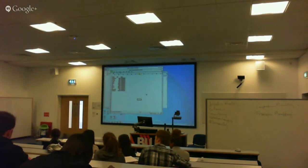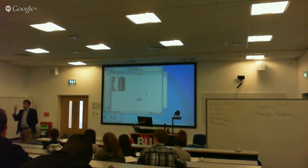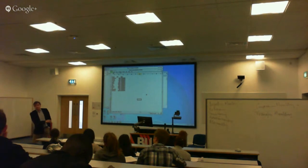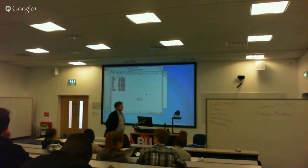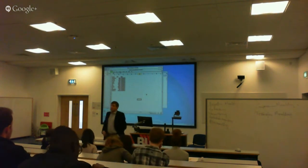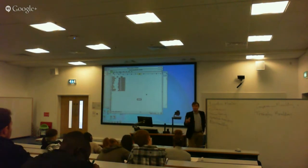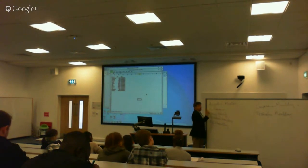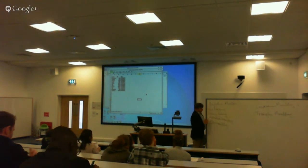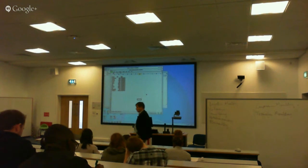But anyway, the most important consideration is how many you are making. The die is expensive, the tool is expensive, and the machinery is expensive. The injection molding machine is expensive. Extrusion, the dies are expensive, though not as expensive as injection molding. The process is expensive in terms of machinery, but not quite always as much. These three are a lot cheaper in terms of mold and tools.